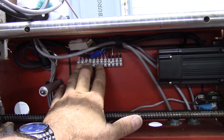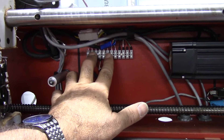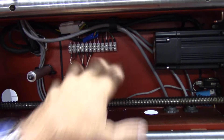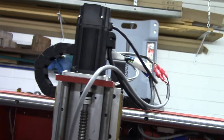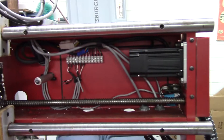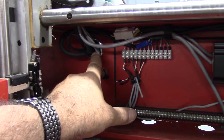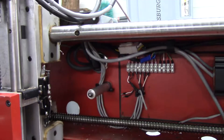I also used a four-conductor 18-gauge cable — this is 22 or 24-gauge shielded cable — and this 18-gauge shielded cable is for future use. Since I had to needle and thread it through the cable carriers and so forth, I just thought I'd add some extra wire. There you see the X-axis servo, and I moved the one-inch liquid tight up above from down below.